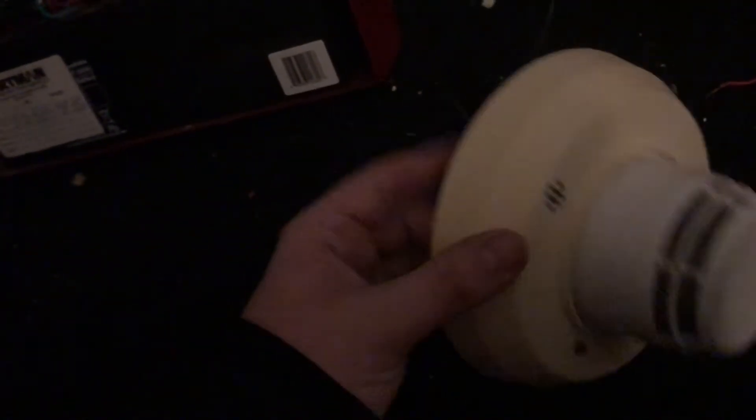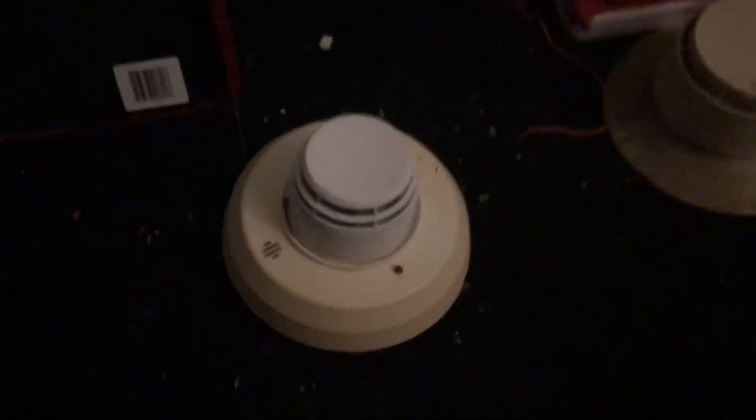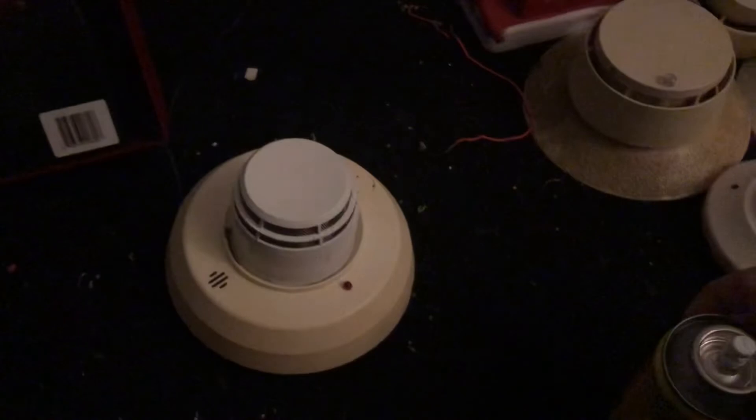You basically screw it in from the back of the unit. I just have two wires in there — terminal one is my positive contact and terminal four, which is really terminal two, is my negative contact. Those other two are for resistance and looping to other devices. This has a spot for a piezo but there is not one in there, and that knockout is likely for a thermal sensor.